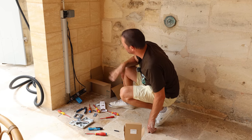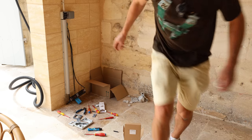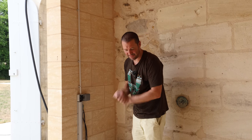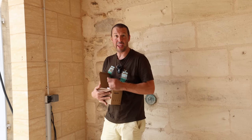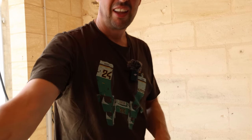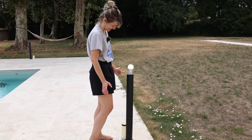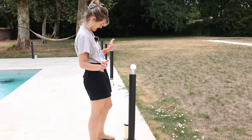Before I put all that switch back and the screws back in, I think it might be worth checking that it works, Anna. I'm going to go put the electric on. It's working, Ed. Yep. And looking down at the transformer, I can see a little green light. Oh, that's nice. And because it's only 12 volts, you can do the honours, Anna, and just screw it in and the light should come on in your hands. Oh, nice. You're not risking anything. And I'll feel like Thomas Edison. Look at that. Oh! So nice. The 12 volt bulb is working with the 12 volt transformer. I understood that part. No, but that means we've done it, Anna.